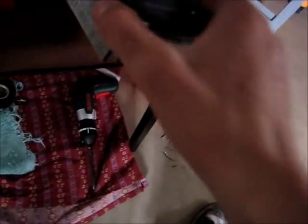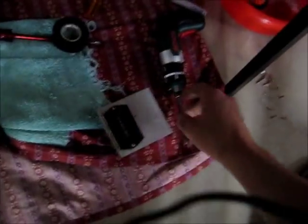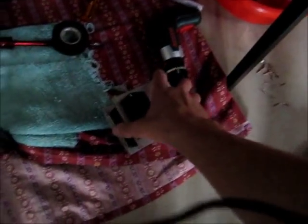Okay, we've got the convergence ICs off. These are the Japanese Sanyos. You can tell the difference between these ones and those ones — these are the Chinese-made Sanyos. Right, I've got the board off. I want to just check everything else, like capacitors, and check for dry joints while this is off. Now I've got to get these set up on a table, on something that's not going to build up static. I'll get these all changed.